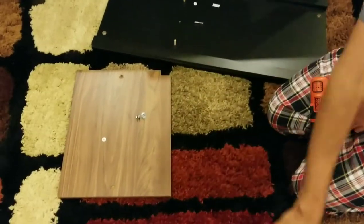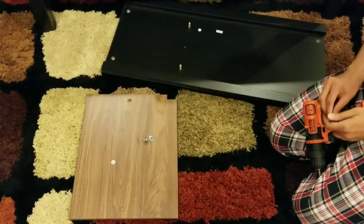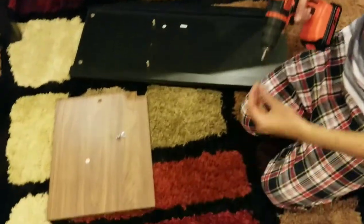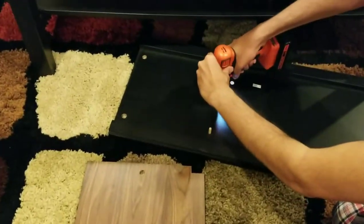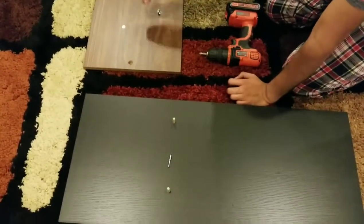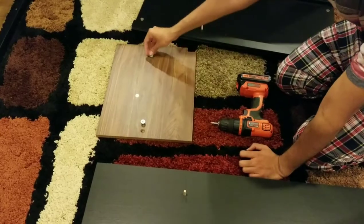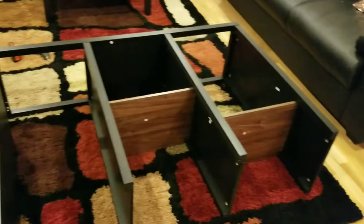Now the same thing — what you did with 4, 5, and 6, this time it is 7 and 8, with 3 as the common piece. Put the two wooden pieces on the side and put this screw in the center, same for this one as well. For 7 and 8 you won't make a mistake because they both have holes at only one place. Then cam locks in number 3 here, pointing outwards.